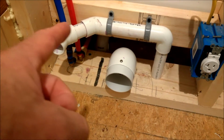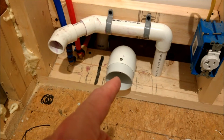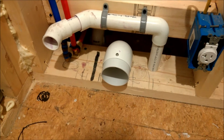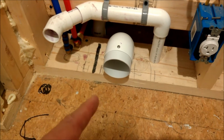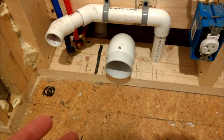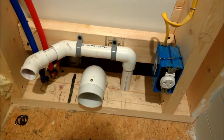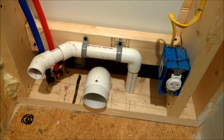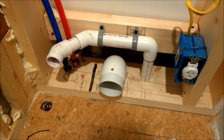But anyway, so we've done this additional plumbing. This is the urine diverter pipe here that goes down and ties into our gray water system, and this is a vent pipe that goes down beneath the trailer for a fan that's actually in the toilet to pull odor away from the bathroom. So we've had to do some reconfiguring, but this is going to save us a lot of weight, and it's going to save us a lot of electricity use, particularly if we were on a generator, if we were trying to do something a little bit off grid. So a little bit of a change, but you can see that I've got a 2x6 wall here, which allowed for the vent, and that was true whether we were using the incinerator toilet or any other toilet, because we still wanted to be able to vent down and through this wall.